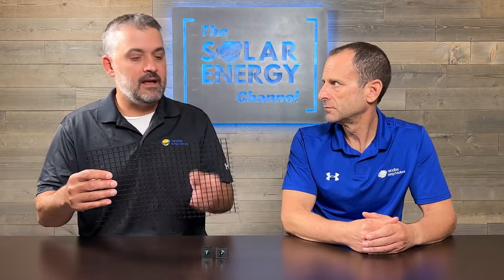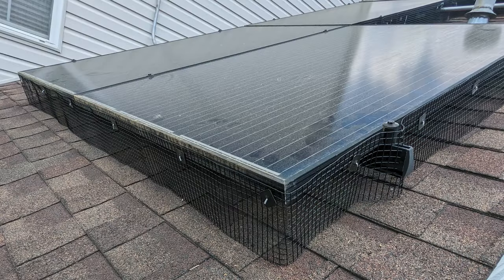If they're causing all of this damage, what type of solutions are available? Fortunately, there's a pretty straightforward, easy solution that works very well and is fairly cost effective. I actually have an example of it right here — it's called Critter Guard. This is actual PVC coated wire mesh, so they're not going to chew through it and they're not strong enough to bend past it. This is installed around the perimeter of the array and around any openings within the array, simply with clips that clip onto your module. It can be done on a typical house in around four hours.